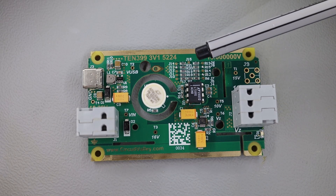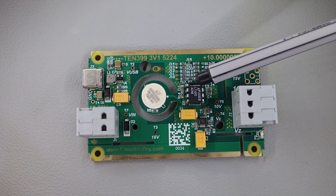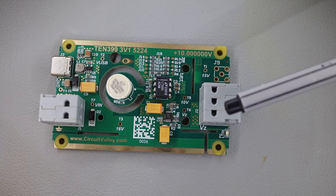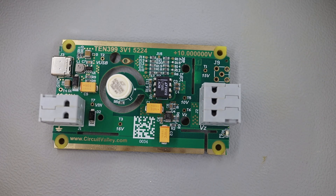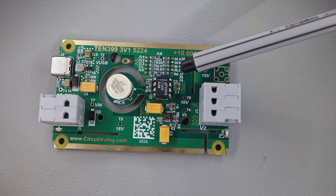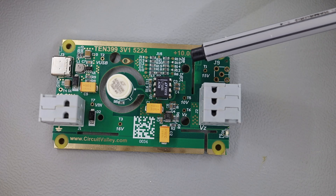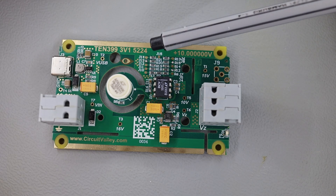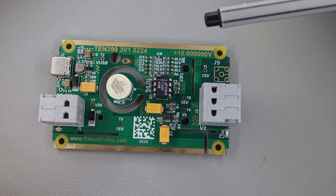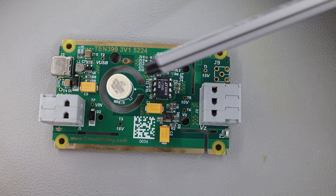You see these small two sets of jumpers — they adjust the value of this 10 volt op amp output. This circuit has two outputs: one is directly from the Zener, which is going to be around 7 volts, 6-point-something or 7.1-something like that, and another output is 10 volts. This 10 volt is generated by this op amp, and the op amp's gain is adjusted by these multiple solder bridges. You can see J5 and J8 are mounted on this side, and J13 is mounted on the other side. This combination can be selected between different resistors. The schematic of this new board is also available on my website, www.circuitvalley.com, and this particular board provides you more stability.